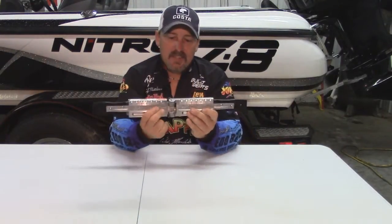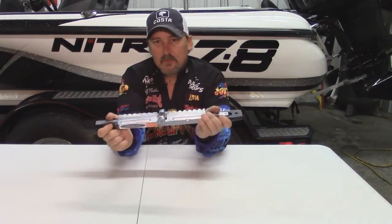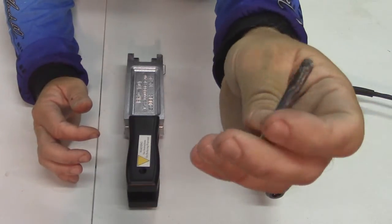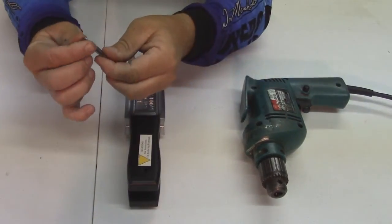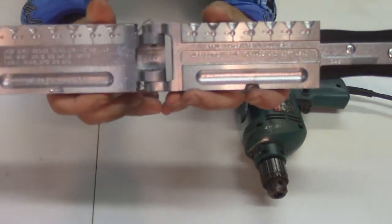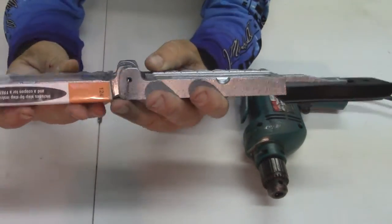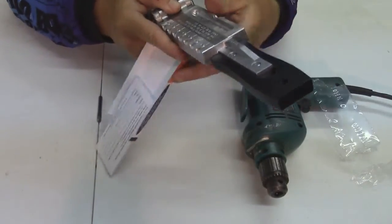On every cavity, we're going to work every cavity on each side with this quarter inch router bit to give us 1.28 gram jig heads, which equals 1/24th of an ounce. Let's get started. I want to show you a pretty good close-up of the router bit before we begin — it's just a quarter inch rounded router bit. Make sure you get a rounded bit so you get the profile of the rounded jig head. The mold we're working with is a barbless 1/32nd ounce, and we're going to clean out every cavity on both sides to give us a 1/24th ounce jig head.